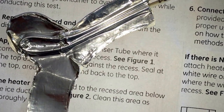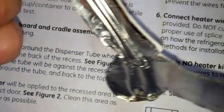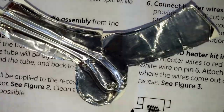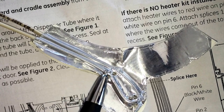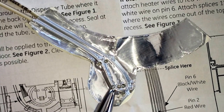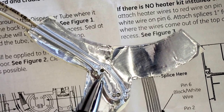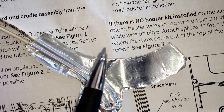This is the heating end of the actual heater. The foil part sticks in that indentation, and it's just an adhesive that holds the wire lead in place. The only part of the wire lead that actually gets hot is right through here, but then this whole wire loop gets warm. My suspicion is that behind the door the water hose goes up and over this way, so this part will get warm. As mentioned earlier, we're going to seal the water hose in the door that will be sitting right about there.